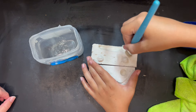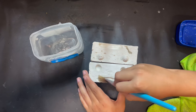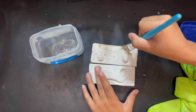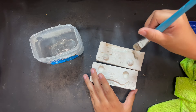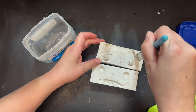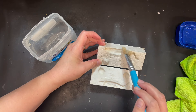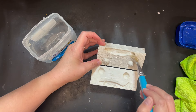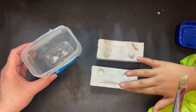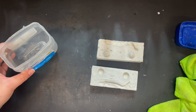The thing with doing a plaster mold with a paddle tail is that you've got to get all in those grooves. It'll be interesting to see if that comes out — we've got to get all the nooks and crannies. Make sure you don't fill it up with petroleum jelly or it won't pour. We also want it to come out. Don't put it on your shirt either — that's probably not a good tip.